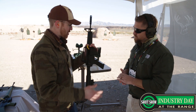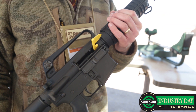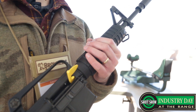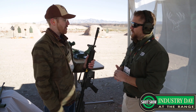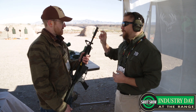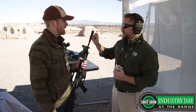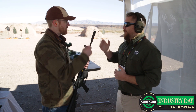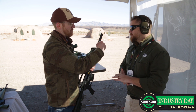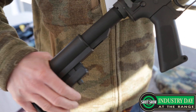The last rifle — actually a carbine — is the XBRM-177E2, an XM-177E2 clone. This basically shares a receiver set with the M16A1, but you've got a carbine barrel with the flash hider, which of course has to be pinned and welded. This is actually a flash hider — the originals were actually a moderator or suppressor with baffles, so this is basically hollow from the end of the muzzle to the end. And of course we have the grenade ring, plus the production version will have a true two-position buffer tube, extended and closed.